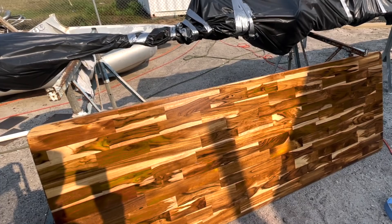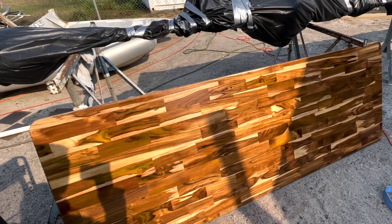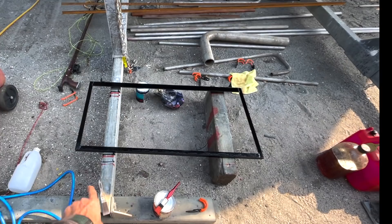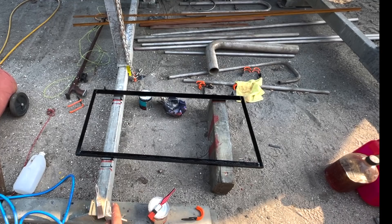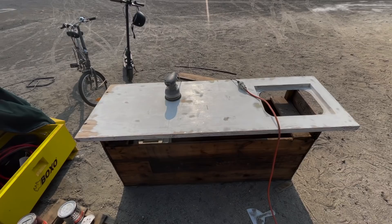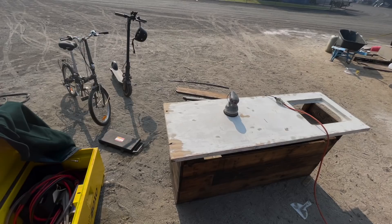The table is also ready to go now. It's had a fair few coats of polyurethane — epoxy on the bottom, polyurethane on top. Teak couldn't just be left; it's very robust timber, but I think it'll stay looking nicer that way. Damien sandblasted the old frame the fridge was sitting on and Vicky's painted it again — much nicer now, sandblasted properly rather than painted on mill scale. The doors are also off the cabin getting sanded and repaired. We'll epoxy them up and redo the sliders so they move much more smoothly.